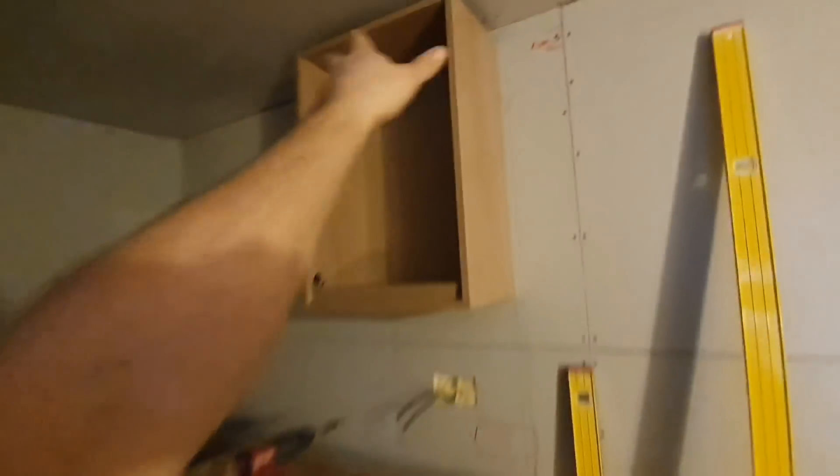This literally took about five to ten minutes just for the marking up - it's really easy to do. I'll get the other wall unit sorted, get the brackets on. The pre-planning is the key. If you get all your noggins in beforehand and do all your measurements, it's going to pay dividends. I ran all my cables up and in the center of the units so no fixing is going to go near the cables.